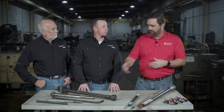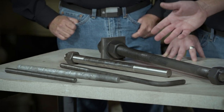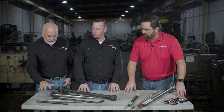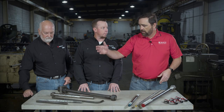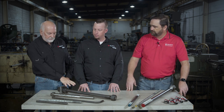We manufacture different types of anchor bolts here: a double-ended stud, single-end stud, all-thread stud, bent anchor bolts with an L-shaped bend, and ones with tack-welded nuts and washers. We also have what's called a swedge bolt — a single-end stud with indentions pressed into it — used a lot in bridge applications, giving the concrete something to grip. The L-shaped bolt is old technology that's been around forever.